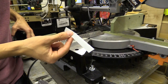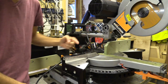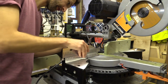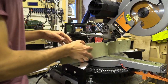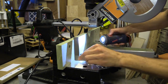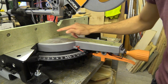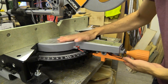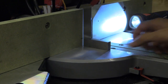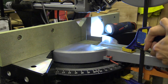I bought this PTFE stuff to shim out the CNC machine. All I'm going to do is place that inside like this on the edge, slide it in, and make sure it doesn't move. This end is good. This one's not great – there's a light bleed at the bottom, same for that. That's good more or less. So it seems square on these sections, but there's a little bit of gap when you get closer to the blade. The problem is still coming from this section here – it's leaning up a little bit, which is causing the gap at the bottom of the square. If I put a bit of weight on there or clamp it down, it starts to close.